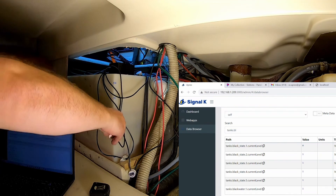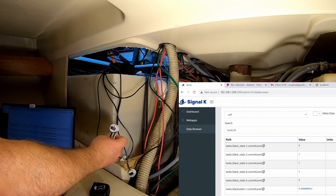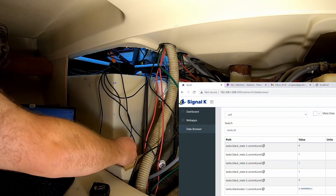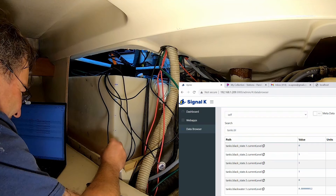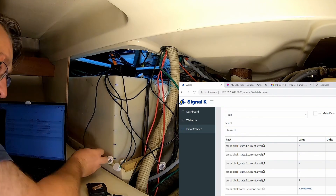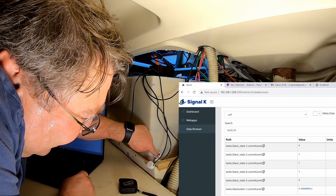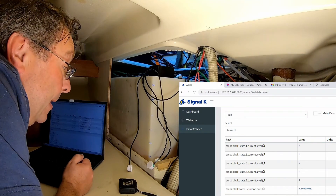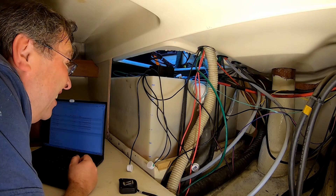So I've got five in there now and as you can see, when I cover five like so, the light goes on and it shows up on the screen at the same time. It takes a couple of seconds to do, but it does. Now one thing we haven't tested, and we're going to do this now, is whether it's actually working with the liquid that's in here. And it does - you can see on the camera there, if I take this and put it on the side here and press down, I get to where the water level is and it lights up. So that works. All I need to do now is wire the other three and they should work, and then stick them on and stick this on top.